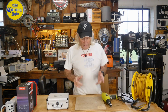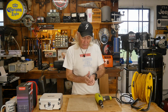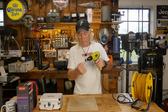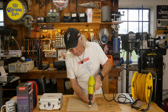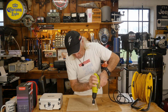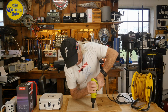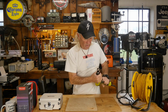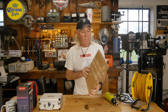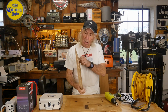Okay, this is just dry, which like I said, I'm sort of against, but I just started a little bit and I've already got what looks like a hole made just about in here. The trick with this, because it doesn't have that center bit to guide it, is to start it on an angle and get a little groove started in the right spot, of course, and then stand the drill up and finish the cut. So you sort of start like this and then okay.